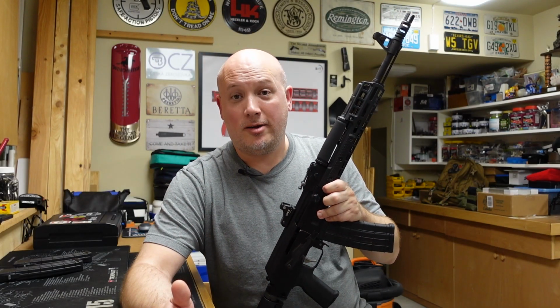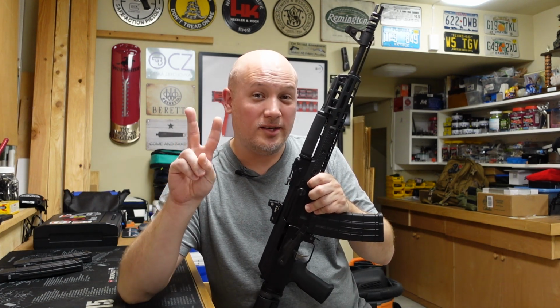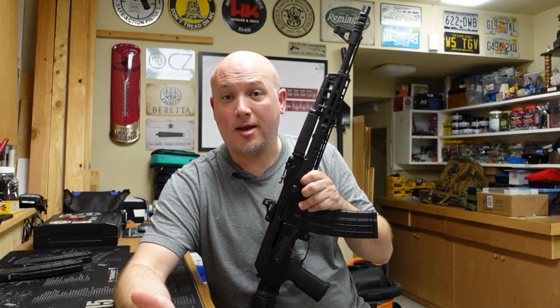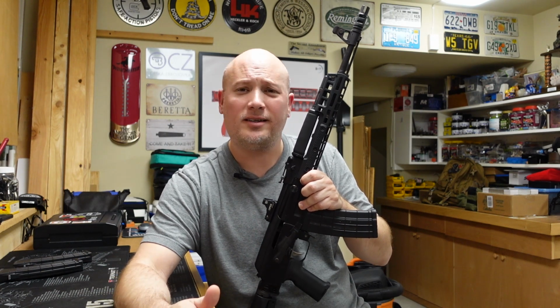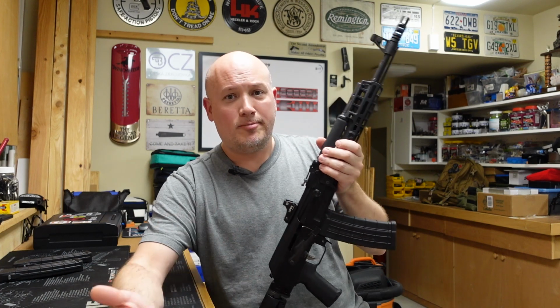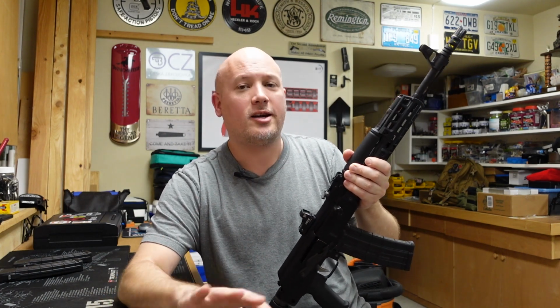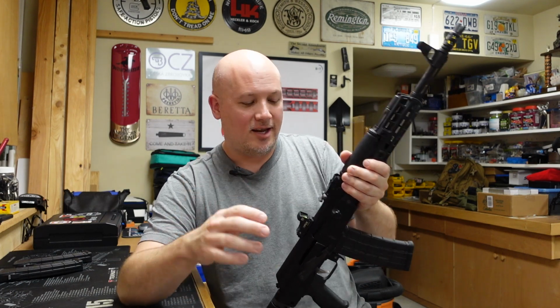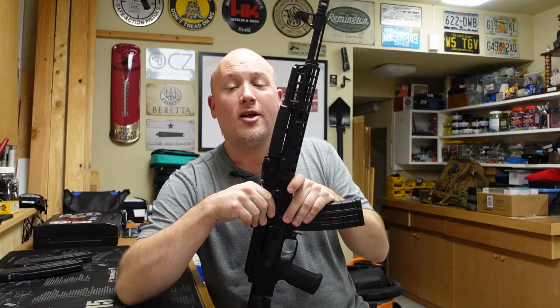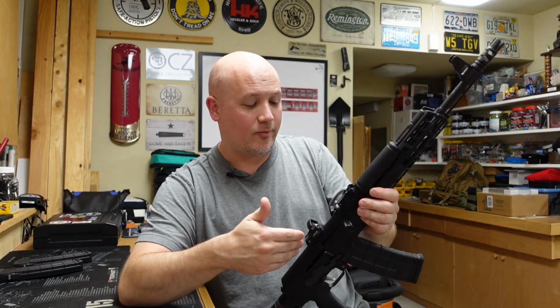All right, so we got some issues to talk about. We obviously had some failures to feed, and I think there's two reasons for this. Number one could be the ammunition. As I mentioned, 5.56 is not as tapered as 5.45 or 7.62, and that's one of the big advantages to those cartridges, especially when it comes to feeding and extraction. 5.56 isn't the same way, and these receivers were never designed for this cartridge, so it does seem like it's getting stuck on those feed ramps.